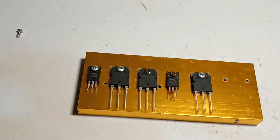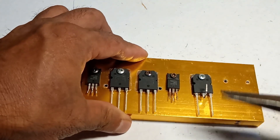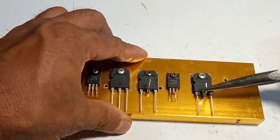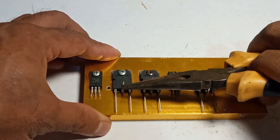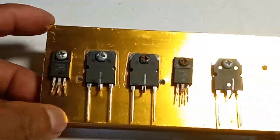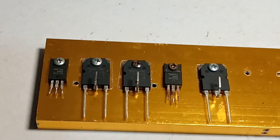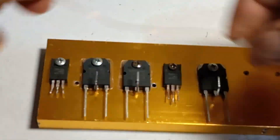6. Packages — commonly available in TO-220, TO-92, and SOT-223 packages. Applications: power supply for microcontrollers and digital circuits. Use in embedded systems where a 5 volt rail is needed. Useful for powering sensors and low power devices. Pin configuration — the typical pin configuration for the 78M05 in the TO-220 package.